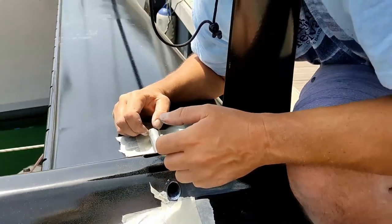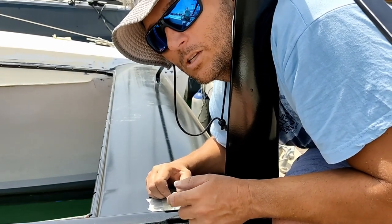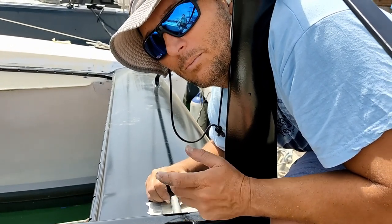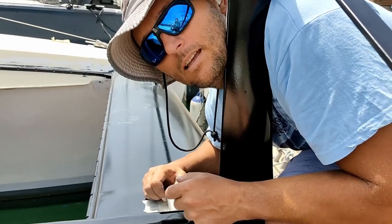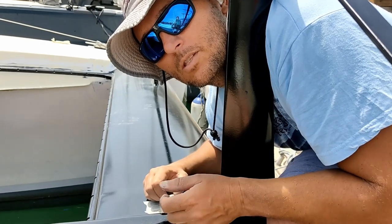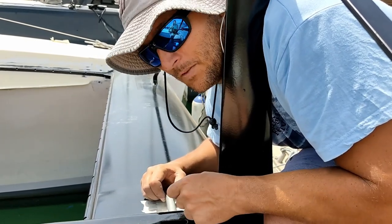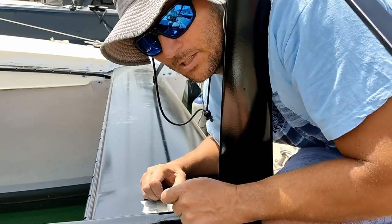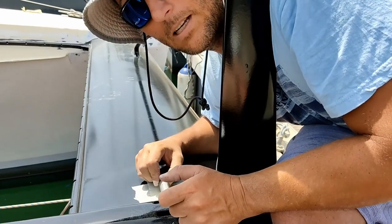Well, we used to do it on our skiffs, and I first learnt this lesson on a 14-foot skiff with a carbon fiber bowsprit. Put some aluminium pop rivets in the fitting on the end, and it took 3 days in a regatta, and it fizzed through the pop rivets, and my fitting flew out downwind, which was pretty uncool. But that was my first lesson with carbon and aluminium and galvanic corrosion and how fast it happens.